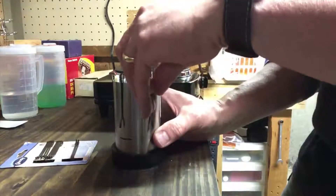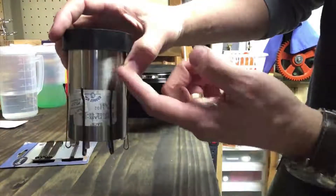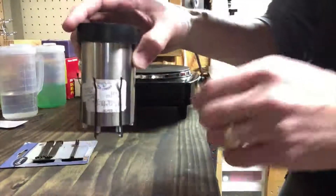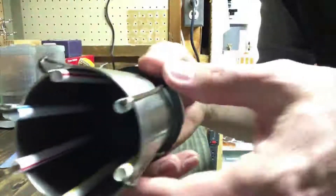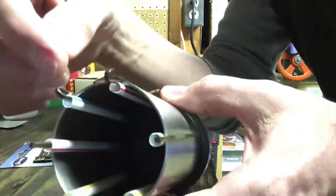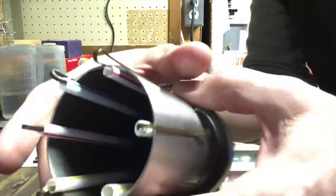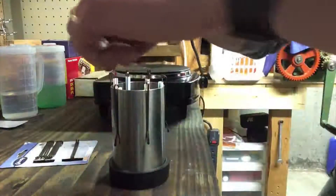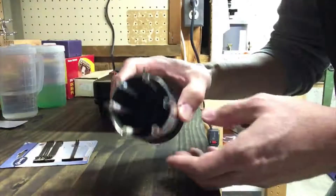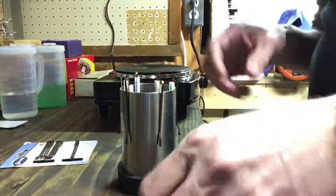What this does is it'll allow, when you're casting, the air to fill up these and pull. What that does is it allows the vacuum to pull from inside of that straw, so you're actually getting more vacuum-assisted casting. Some of the flasks they have now are perforated — you don't need this for those. But you can also use the wax web and put it all the way around and it does the same thing. I like to use the straws because I can put them close to the wax that I have inside that's casting.